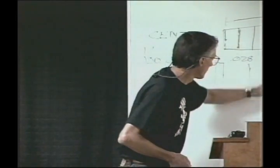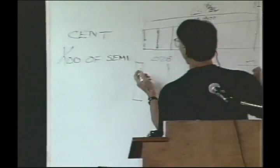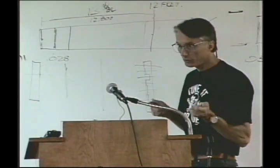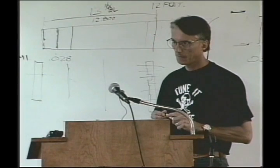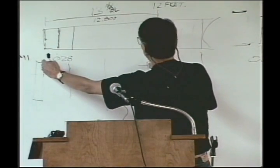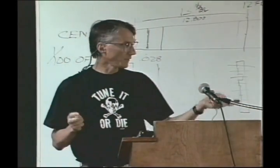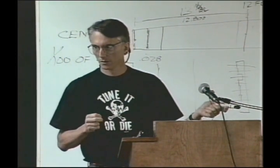The 12th fret. All right. Here's the 12th fret. What we're doing is, each string has a different optimum nut position, a different optimum saddle position, and it's going to be different for each string. The idea is to use the same fingerboard for all the strings. So what's going to vary is the nut and saddle positions. The fingerboard is fixed, but the length is going to vary between nut and saddle for each string, and the actual positions are going to vary. And it turns out John's system works quite well, and in fact, it doesn't end up being that different than this one.